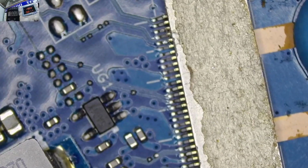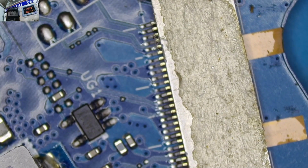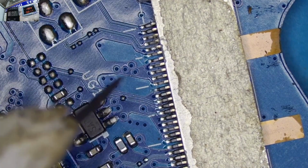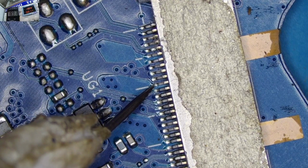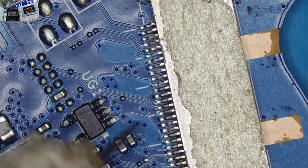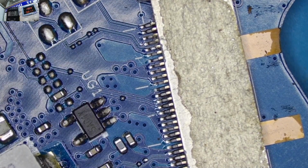Okay, so the screen connector is here. How do you know the 19 volts? You look on the bigger power tracking pads, like the 2 or 3 pins connected together. As you can see in this one, you have 2 pins connected together. Did I see some 19 volts there on the meter? Yeah, we have our 19 volts on the screen connector. About these two, we're also having some pins connected together. Yeah, our 19 volts on the screen connector is present. So there's no doubt our 19 volts power rail is okay.